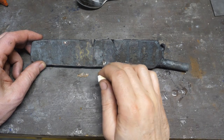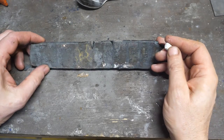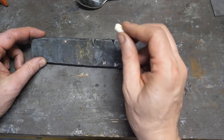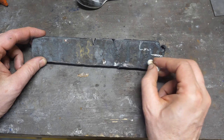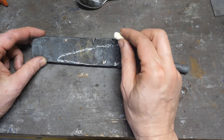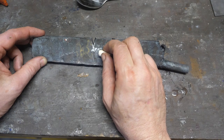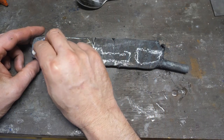I'm not going to pretend that's not devastating — that's a pretty bad deal. This was going to be a nice eight-inch something and now it's definitely not. This is the final vertical weld where I had the six pieces stacked, and it opened there and there, which I just don't understand. I could try to forge this down over here and make a tang and work underneath this stuff, but I don't trust that either — there's a good possibility these splits are going to extend more. Or I could come in here and use this area to make some fittings for a knife as I make the blade out of that.